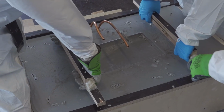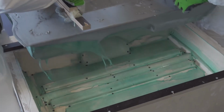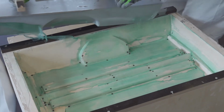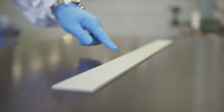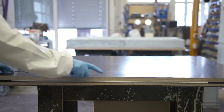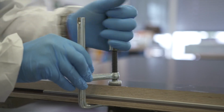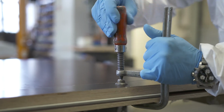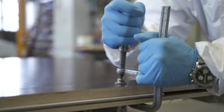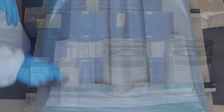The cast mold should be removed carefully. Remains of ALWA release lacquer can be easily removed with warm water. After curing, flat or thin molds must immediately be placed on a flat surface in a hot state for cooling. For example, they can be clamped or weighed down on a level surface in order to prevent a bending of the mold and thus the bimetal effect. The molds can be easily machined.